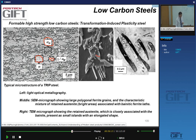In this microstructure, and now I'm drawing, I'm being an artist here, I recognize some of what used to be, and we'll see in a moment, intercritical austenite, that has transformed by a bainitic reaction to this black stuff here, which is basically bainitic ferrite, and this smooth stuff here, this is the so-called blocky microstructure, or this elongated constituent here.